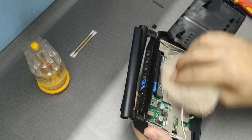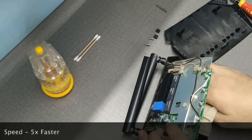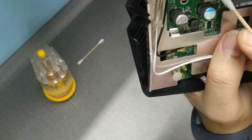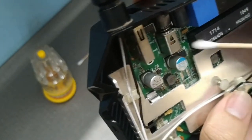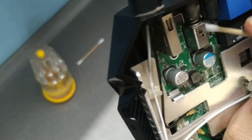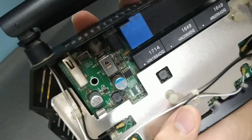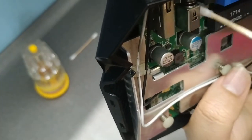The solution is to first take the cloth and clean everything very thoroughly — wipe all sections. Then take cotton swabs, which are the main repair tool here, and make sure there is no dust in or around the SMD components and no moist dust or water residue. Wipe carefully like this. This board is still relatively clean because I cleaned it last time and used three cotton swabs then. There may just be one or two dust particles shorting the circuit.